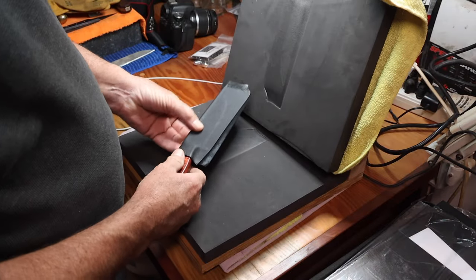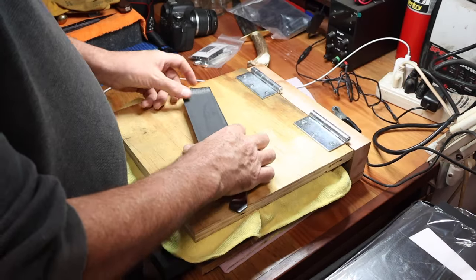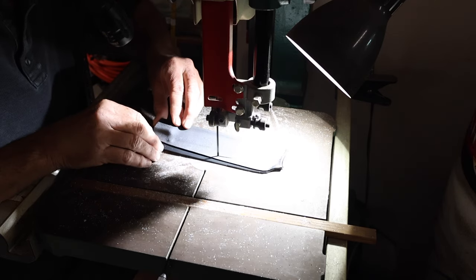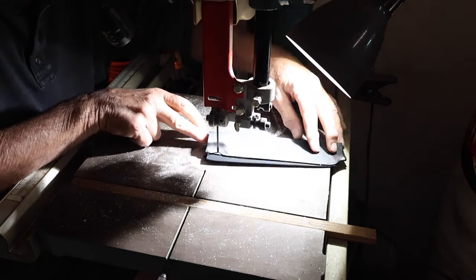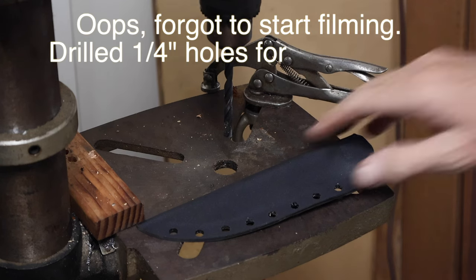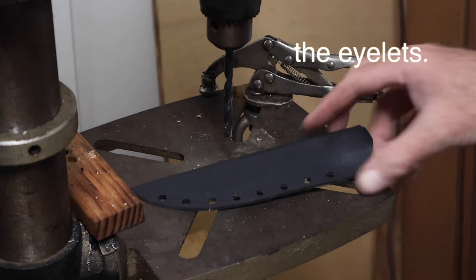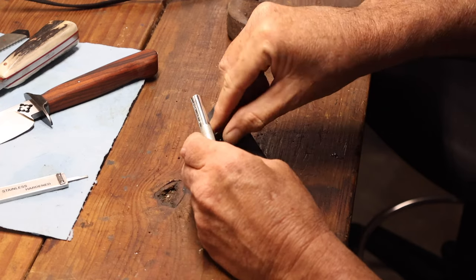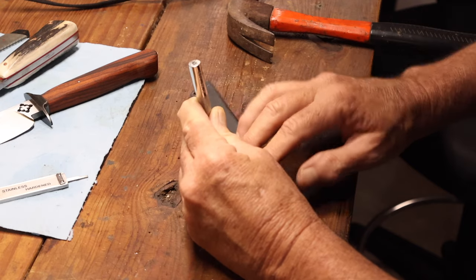Taking it out of the press — I think it did okay. I'd give it about a C-plus as far as how well it formed. I didn't get a good even fold; you can see I got one side a little longer than the other, but I still left enough on the other side to cut it out. I just trimmed it to shape on the bandsaw and drilled some quarter-inch holes on the drill press for the eyelets. I also sanded down the edges on a sander before putting the eyelets in, just to smooth up those edges.